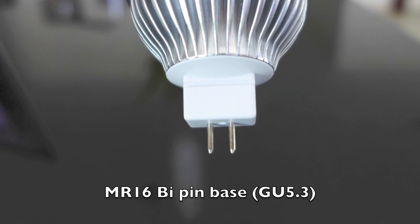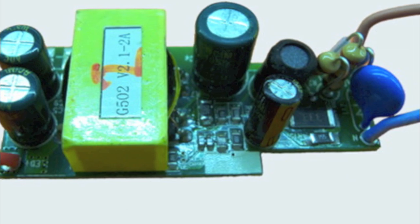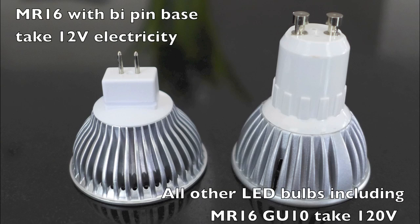Next is the LED driver. This is something you won't see from the outside of the bulb — it is housed inside and away from harm. The base feeds raw electricity of 120-volt AC and then converts it to a lower DC electricity specifically designated by the LED chip maker. The voltage and current have to be within a tight window for the LED chip to work. Note: unlike all other LED bulbs, MR16s with the bi-pin base are just too small to have the driver in the base, so the driver or transformer is a separate component, usually tucked up inside the ceiling.